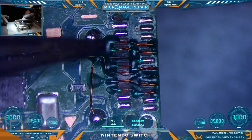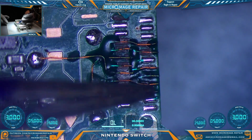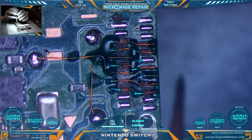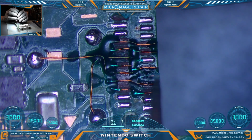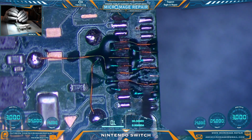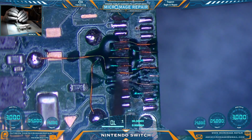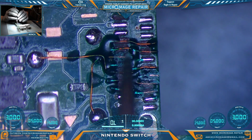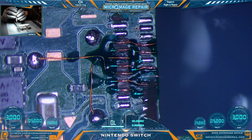We should be thoroughly cured at this point. And we are rock solid. Excellent. Now we're going to need to do some strategic scraping and prep. Scrape the enamel off these jumpers. Can burn the enamel off, but either way works. Do what you're comfortable with doing. Just a tad more. I want it to make contact with the pad.